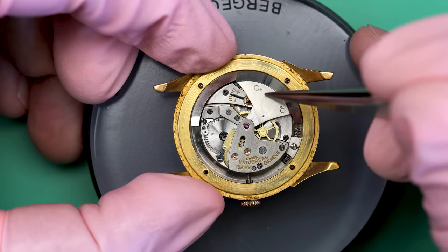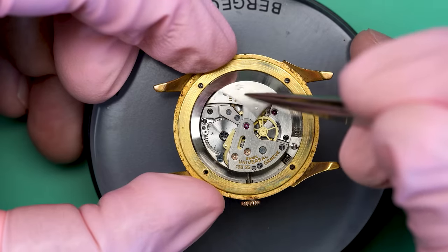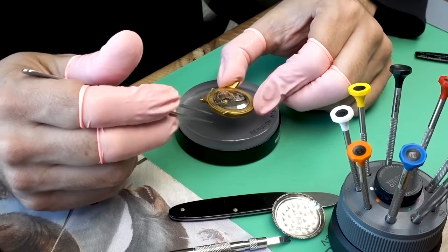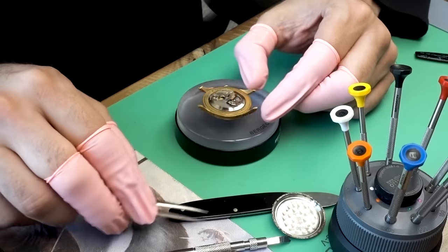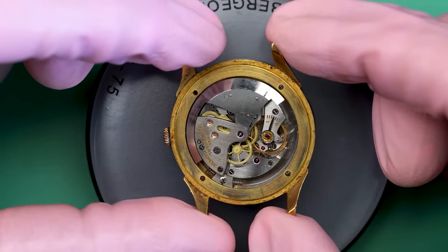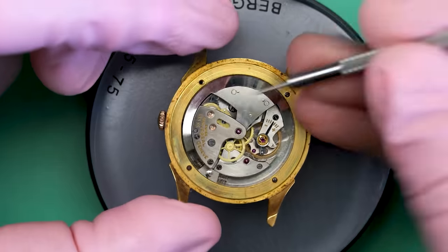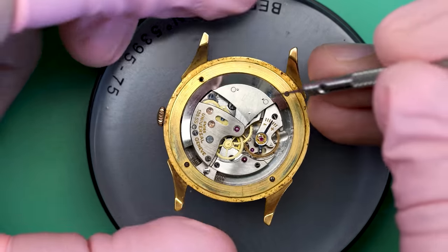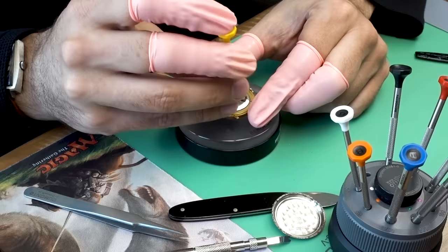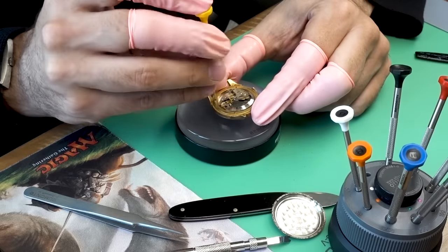That's one of the many reasons that I love watchmaking. You can see the bumper movement here. This is a way to automatically wind the watch that doesn't use the free spinning rotor you'll see on most automatic movements. It has a rather heavy weight that bangs up against those springs at the bottom and goes back and forth, and when it does so, it winds up the watch. There's a screw missing here, but this is just on the movement support, so I'm not sure how important that is.